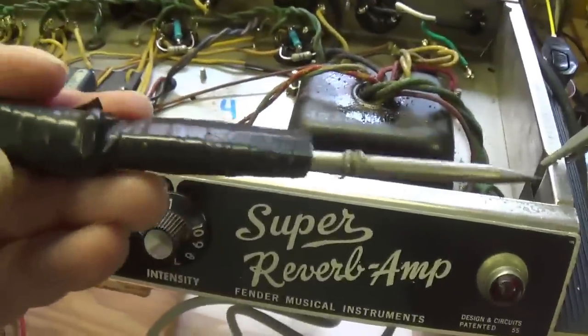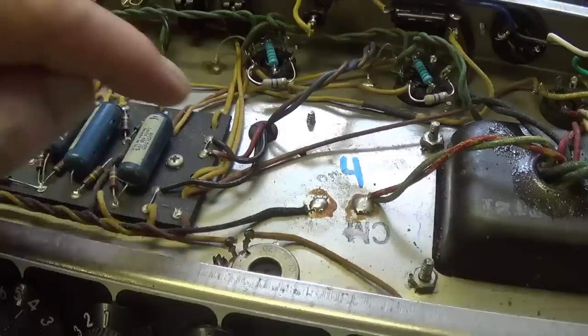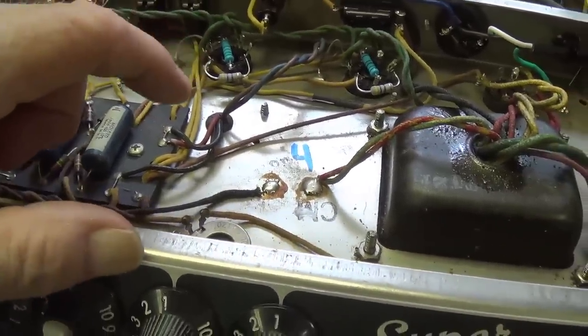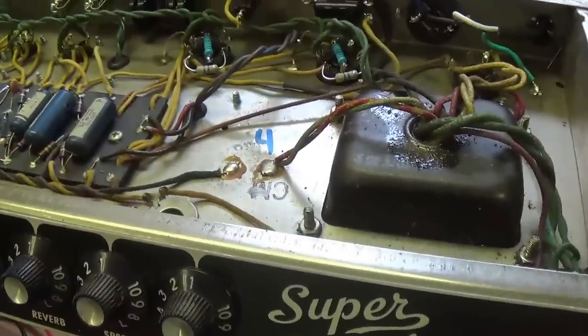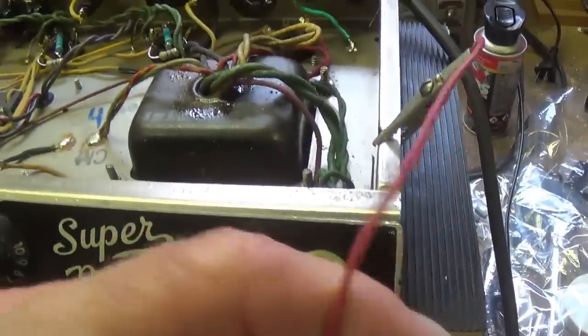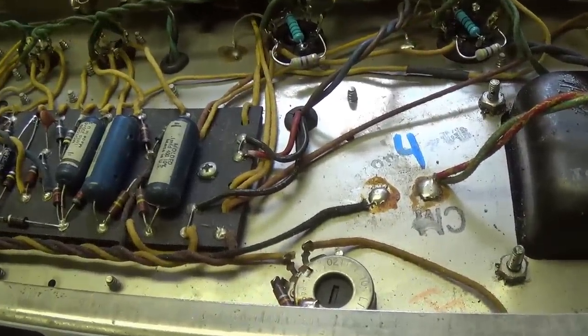Okay, it's essential that you do this because even after you've turned off the amp, the capacitors will hold a charge, so that if you touched a B-plus spot and the chassis of the amp, you could receive just a horrendous shock, and we don't want that. So make this tool and use it every time you work on an amp.